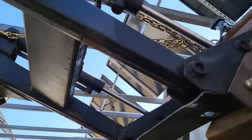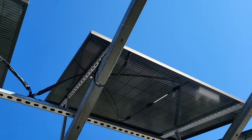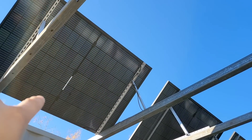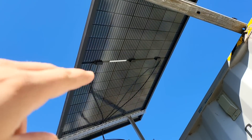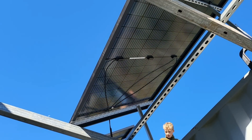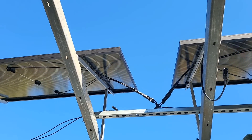We're trying to figure out the most efficient way to run our wires. These three here are grouped together right now, and it kind of breaks my heart not to run them really neatly. Over here we started doing it nicely — wires neatly zip-tied to the edges of the rails — but for efficiency, this side is much better. We just have cables coming directly over and down into a piece of unistrut we're using like a tray to hold our wires, and by doing that we can have these two panels directly connected with Y connectors.